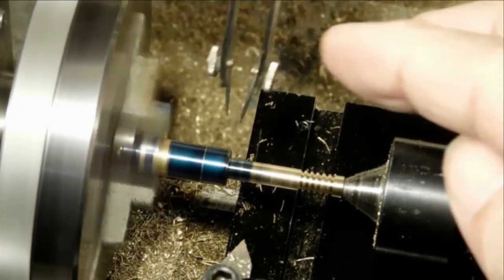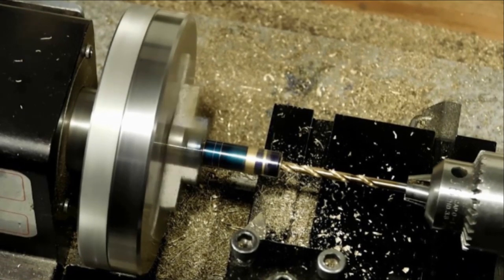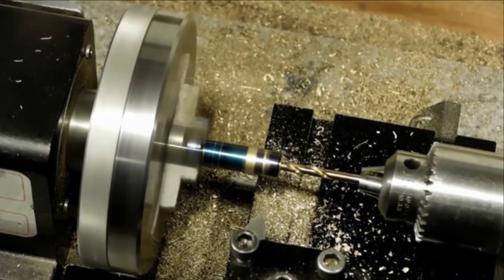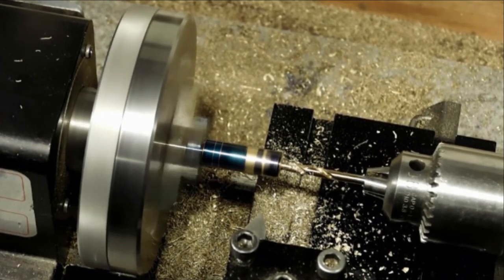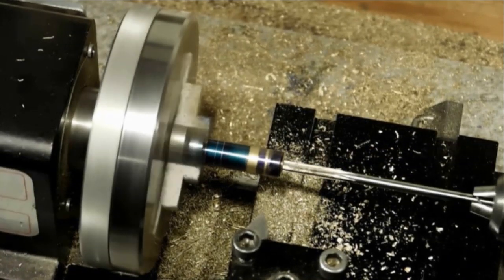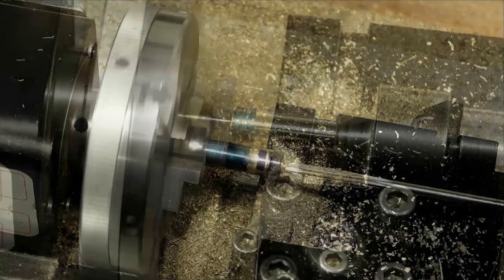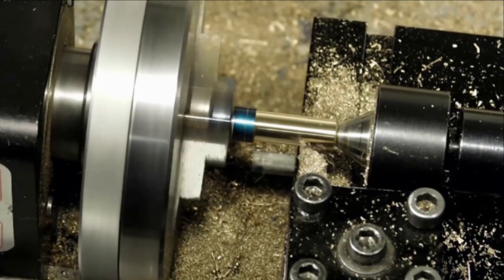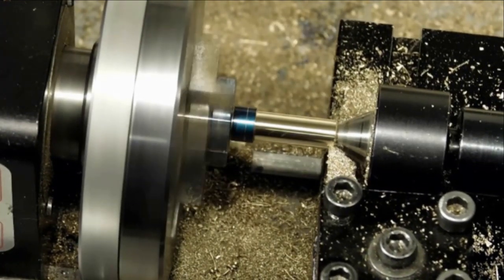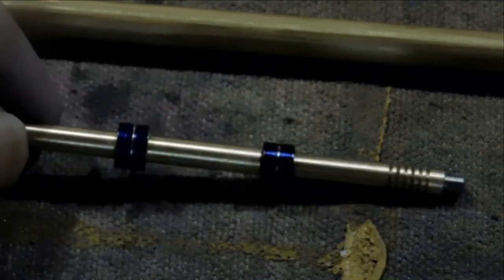We mark it again — this second mark didn't come out so good but we'll fix it. Center drill it, now we drill through until both holes meet and then ream it through. On this second piece we also have to turn the backside down to the OD. This is where we're going to use the slitting saw to cut four slits in it. Before we do that — it slides on good — let's head upstairs and use the watchmaker's lathe.